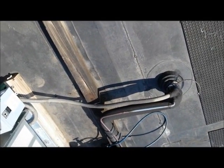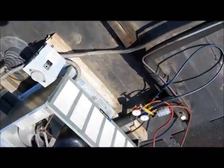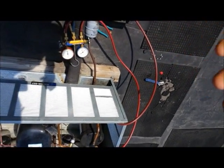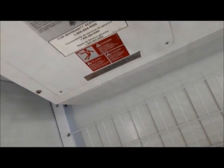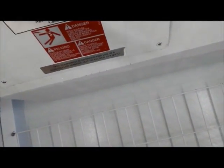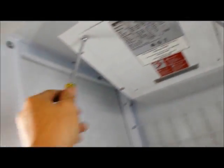So minus 35, and whatever the temperature is at the bulb — I'm looking for a superheat of 10. I think we've lost our power element on the expansion valve. So we go downstairs, put our thermometer in, take our readings, find out what our superheat is. I should have 10 degrees superheat but I have minus 28 superheat. So I took the cap off the expansion valve and turned it clockwise a quarter turn. Now I'm waiting 15 minutes for the vital signs to settle.